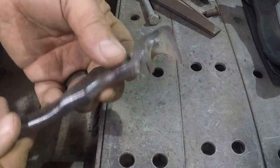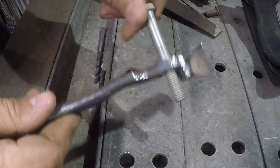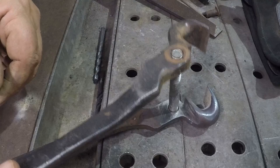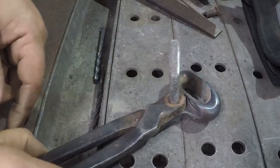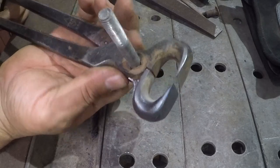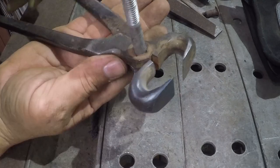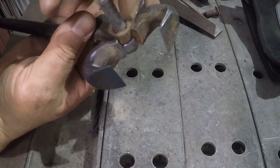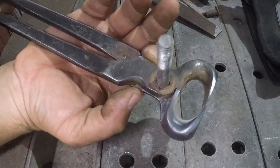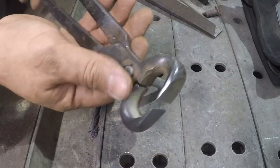That's a half decent rough cleanup. Let's see. Put a new pivot. How these line up. Oh, that's right. Once upon a time, I did file the stops on these. Just a question. Do I just weld it back up since we've been welding? Build it up, establish a new stop so they sit flush there. Yeah, I think that's what I'm gonna do.